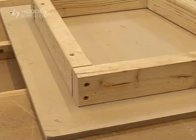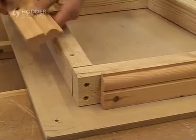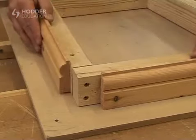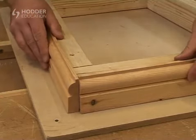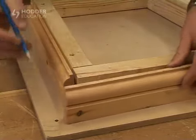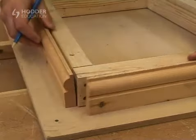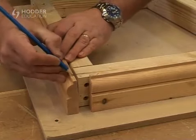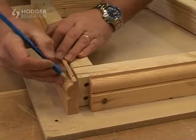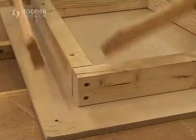During this demonstration, you'll see the installation of skirting boards fitted around several different angled corners. To begin, the moulding is going to be returned around an external corner. This is simply achieved by cutting a mitre on each end of the skirting to allow the joint to close together to conceal the end grain. It also permits the profile on the timber to run continuously around the corner.